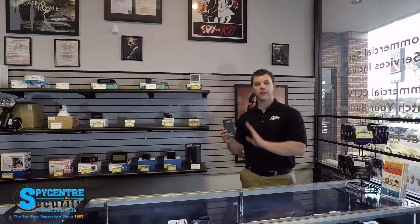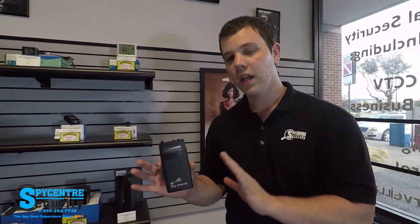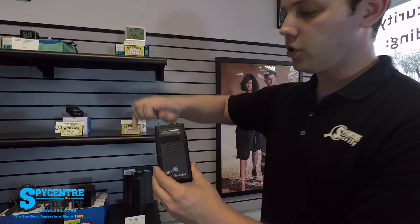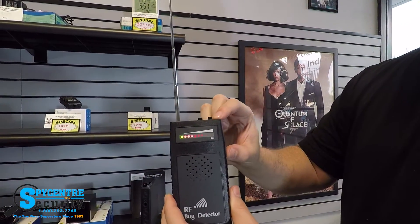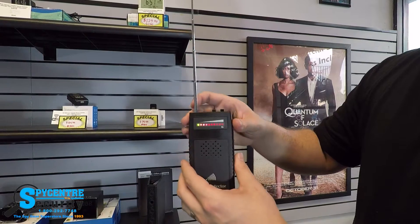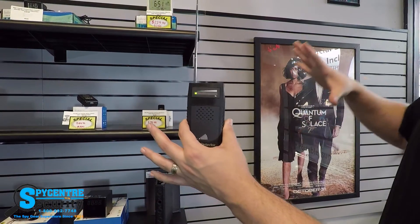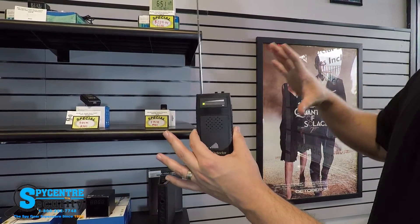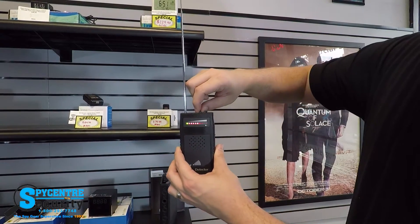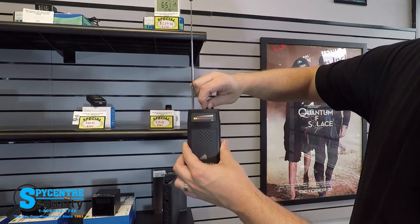Now that I've given you a tour of the device and shown you how to use it a little bit, let me show you how to calibrate it. Calibration on these devices is extremely important no matter what RF detector you're using — if you don't calibrate the device properly, you will not be able to find anything. To calibrate, extend the antenna, power the device on, and then use the sensitivity gauge on top. Visualize a bubble: if you adjust the sensitivity to be extremely high, you're expanding that bubble and extending your detection radius, but that's not what you want. You want to pinpoint and locate something, so adjust your sensitivity until you're detecting something, and then slowly dial it back until you're just outside the radius.